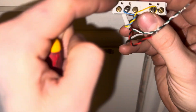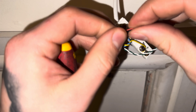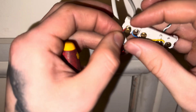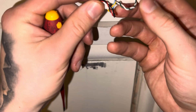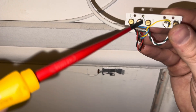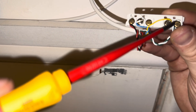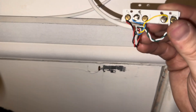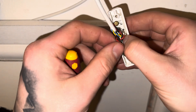You have gold screws which you can use to tidy up the other inner cores — red and black go underneath one, and green and white into the other side. So you have the zone across the silver screws, a spare under one gold terminal, and the tamper under the other gold terminal. Push the terminal block right the way in and push the cable into the slot we cut out before.